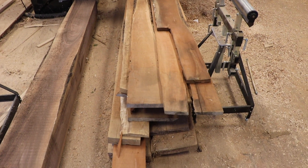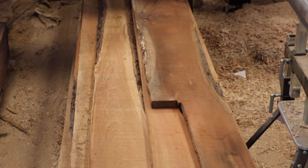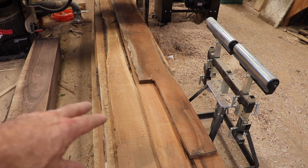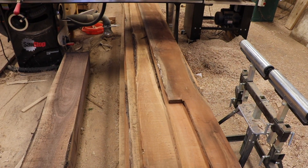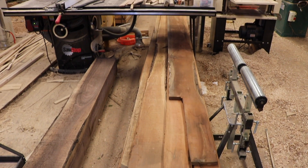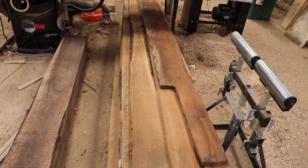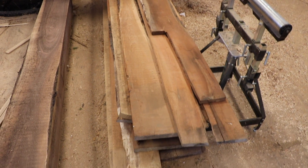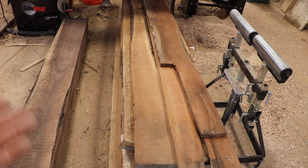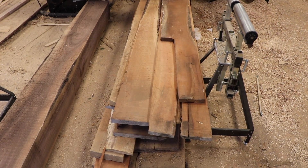So I'm going to commit a cardinal sin — this is what I'm going to use for my mantle, which is going to be painted when it's done. This is cherry. This is stuff that I milled myself years ago — some of it's really nice, some has bark and defects. I've tried to sell some over the years but nobody wants to pay much for lumber that's not from a lumber yard. The most I've been able to sell any for is $1.50 a board foot. If I turned around and bought poplar I'd end up paying just as much, so I'm just going to use the cherry. First thing I need to do is joint and plane and get this to dimensional lumber.